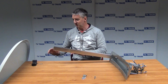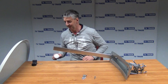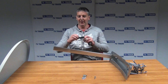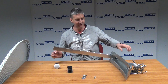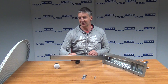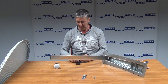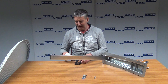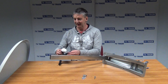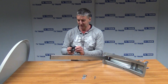At this point we can come along and put on the LNB. I'll pull apart this plastic holder. The design of the LNB bolt here is exactly the same design used by Triax, Amico, Inverto, etc. — so if you have LNB holders from these, they'll work perfectly on this. The design shape of an LNB itself is always 40mm, so that works out quite well.